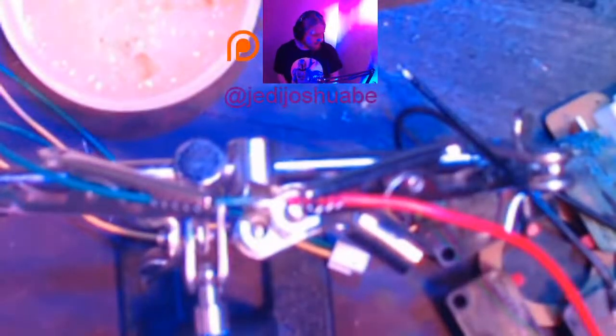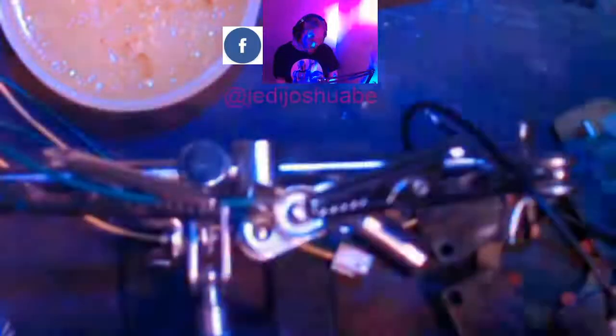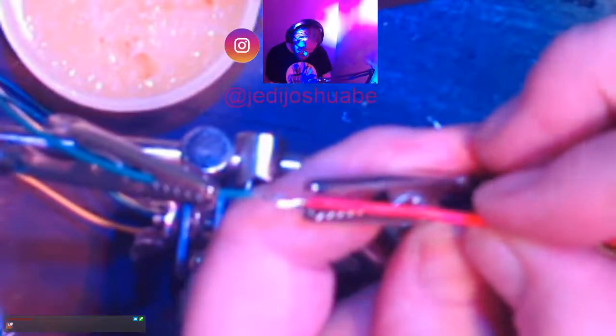And so what I'm going to do is I already prepped each one of these ends by cleaning them up, making them the right matching length, and then putting a little bit of rosin on them. Now I'm taking a little piece of thermal insulation, and it just uses a quick little lighter burst to seal that off. You're going to have to make it within that tolerance range in order to fit through. So you slide these on here, and sometimes I solder something and then I forget.